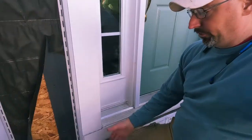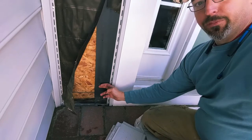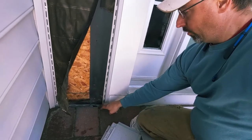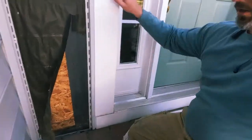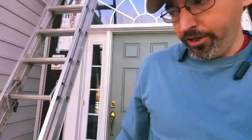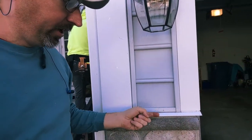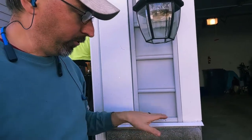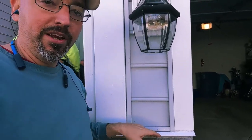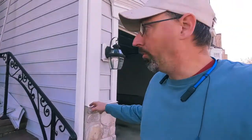Any water that gets in there is going into the house — it's got nowhere else to go. So how do we fix it? We're going to fill that void up with cement, put a piece of L-flashing down and out onto the top of the stone, and then bring our house wrap down over that. Then we can J-channel and do some different things. See how they've got this piece of metal cap? That's what we want — a piece of L-metal that comes down and then out about an inch onto those pavers to protect that mortar joint from water getting down in there and living in that hole underneath.